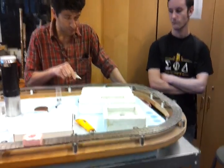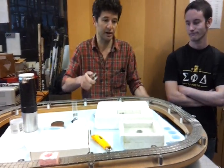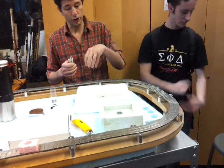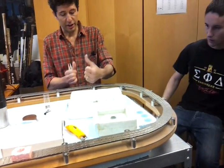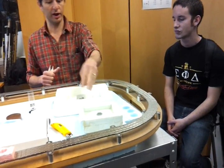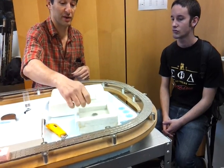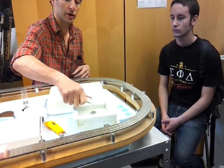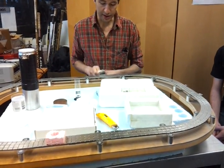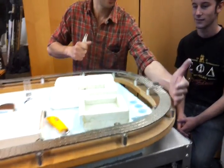Now you have magnets here. What you do is you put it on, and this thing repels magnetic fields, or pushes them aside, because as soon as you get it close to magnetic fields, currents will generate and shield it, so it's basically floating. Now these magnets are designed so that the poles are opposite — two are going this way and the other one is going that way. If you take it and press it on, it stays on, because you're trapping some magnetic flux and holding it in position. And then it also holds it balanced. So now it stays up, and I can also push it. The problem is that we go until it gets warm, and then it falls down.